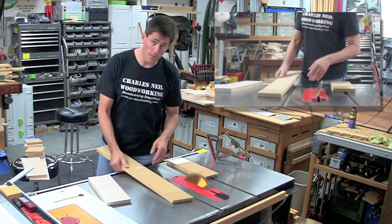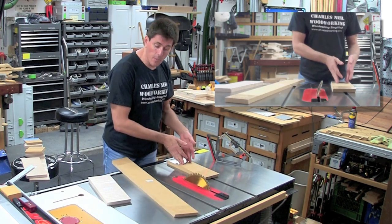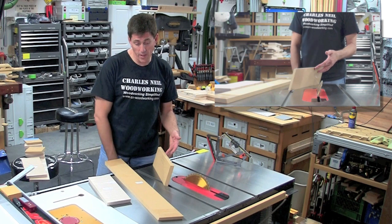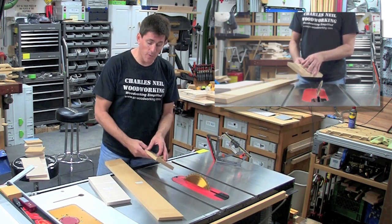Now, it's not just a matter of running it through twice like that. We do have to get the width correct, and the width is different because of the inclination. Now, the topmost box is going to be 4.5 inches thick, but of course, that's a different width for a board inclined this much versus a board inclined this much. So each one of them has a different width.